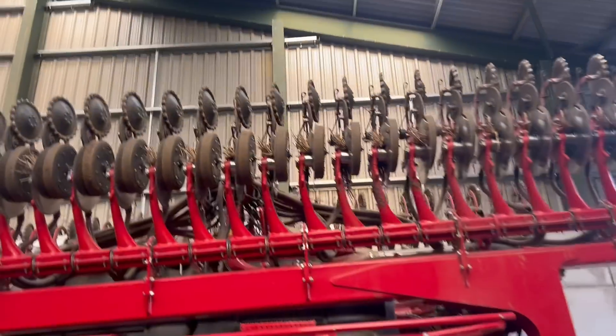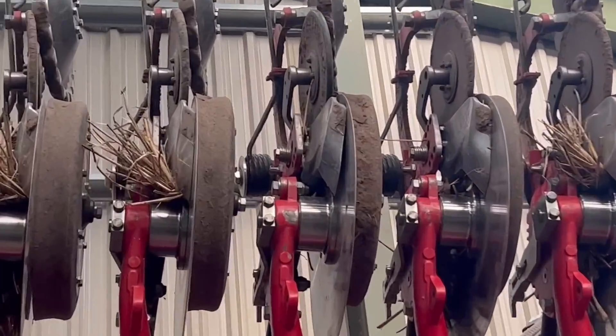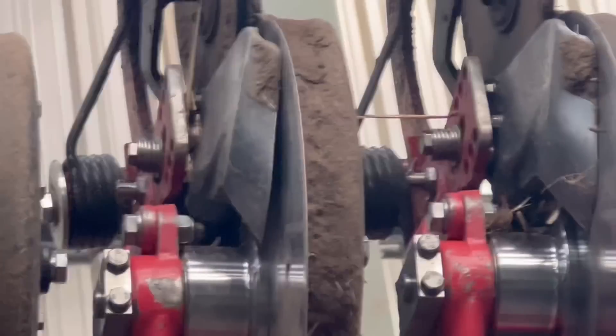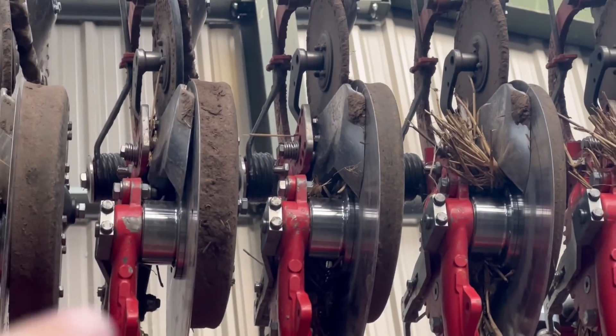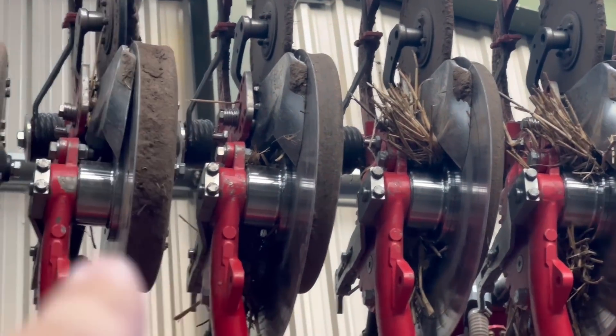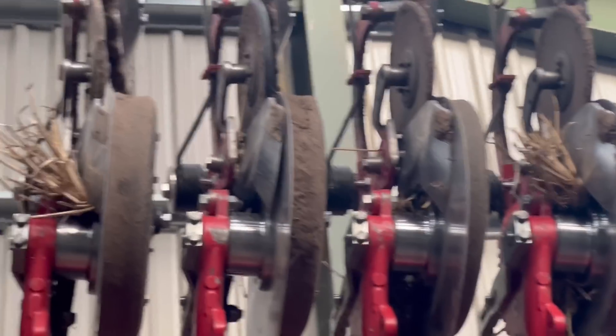Nemo's got a nail in the tyre, everything in the tread. Andrew's just setting up some of these - you can see that one there has got a gap and the rest haven't. So something's come amiss. You often have to move a washer around and tweak it because if it's not touching the disc properly it lets soil in and blocks, which is really annoying.